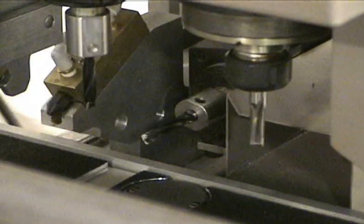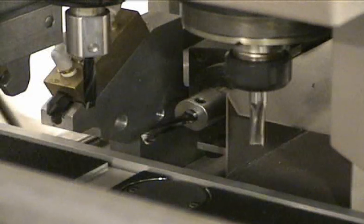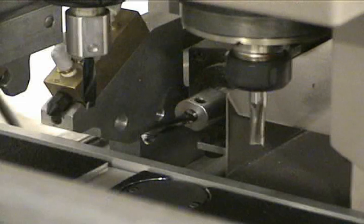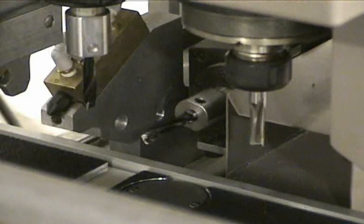The carriage allows for horizontal and vertical tooling. Depth of machining may be done by digital hand wheel or by CNC control. Any number of tools may be mounted horizontally or vertically.